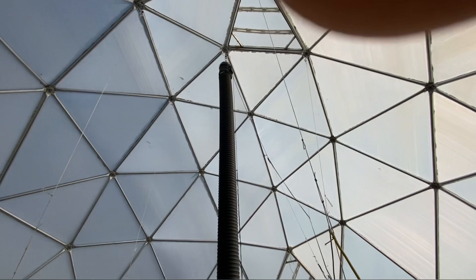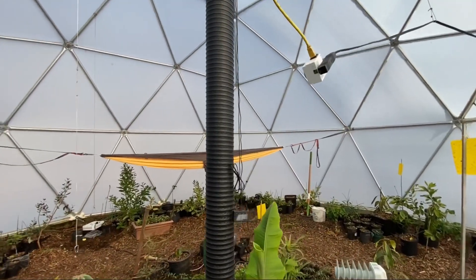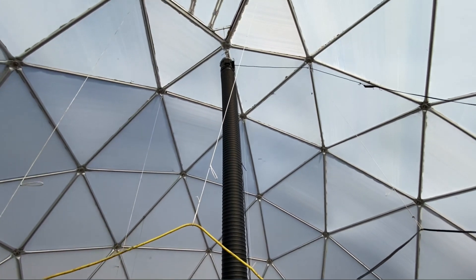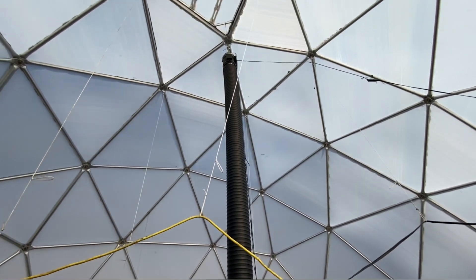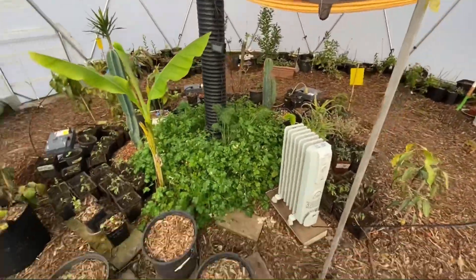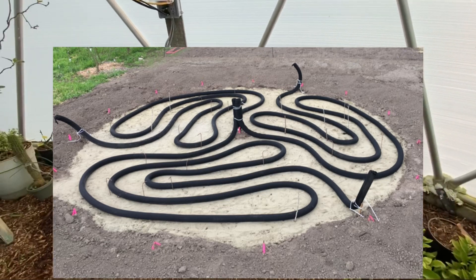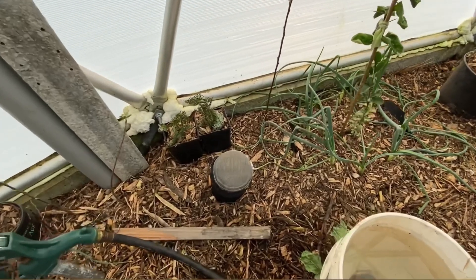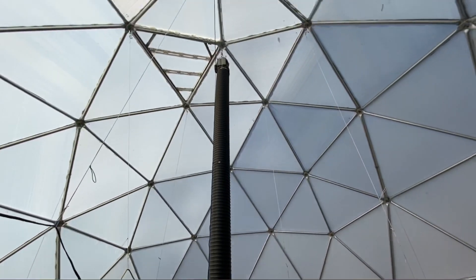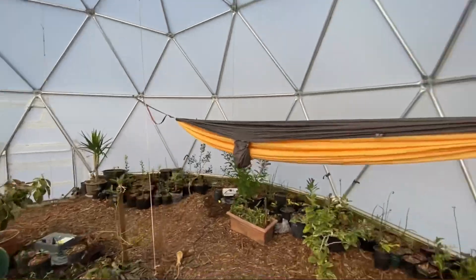This fan turns on when it's too cold at night. I have a setting down there — it'll switch on when it drops below 40 degrees. It still drops below 40 at night here, and it's March 22nd in Zone 8 — it drops actually down to freezing some nights. So this fan keeps this greenhouse above 40 at night just from the heat that's stored in the ground. There are three pipe exits around the greenhouse. It turns on during the day when it's too hot to pump all the heat underground, and then at night when it's too cold the fan will turn on automatically again and heat the greenhouse up.